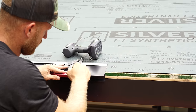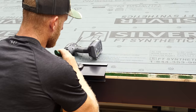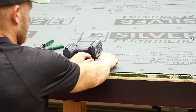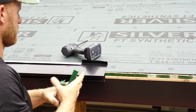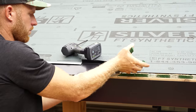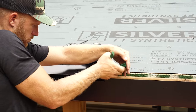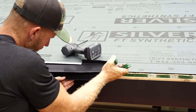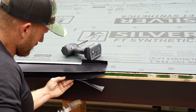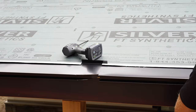But the reason we held off on this was mainly because we wanted to have the ability to go up there and install the windows and do what we had to do without damaging this. We wanted the gutter guys to get up there and install the gutter without walking across this metal after it's been installed. The unfortunate thing is we can't do our side steel up there above the porch until this steel is on, because there's a transition trim up there at the sidewall where it flashes from roof to sidewall, and that can't be installed until after the roof metal is down.